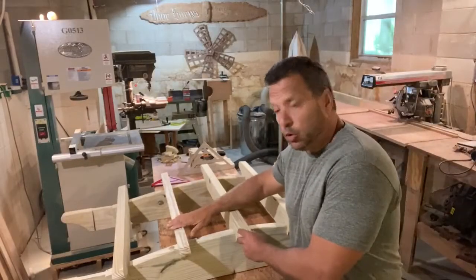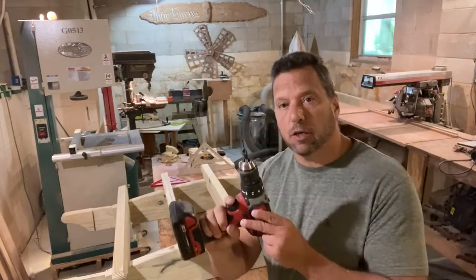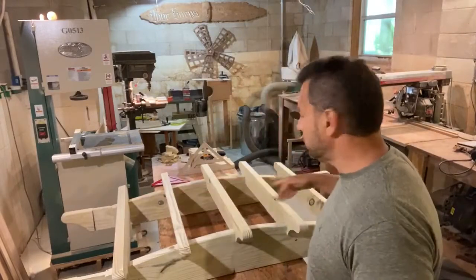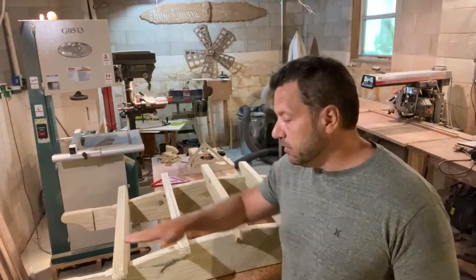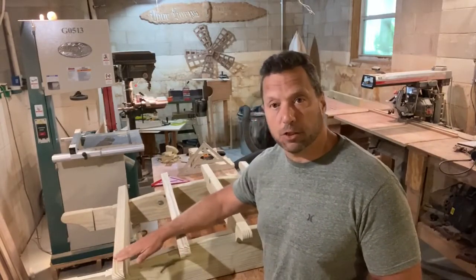We place the shade joist at the locations on the header. Next, we're using a number 8 countersinking bit to locate the decking screws at the center point of each of these joists. We're going to countersink about 1/2 inch, and then we're going to dowel over those with some dowel and glue and sand that flush.